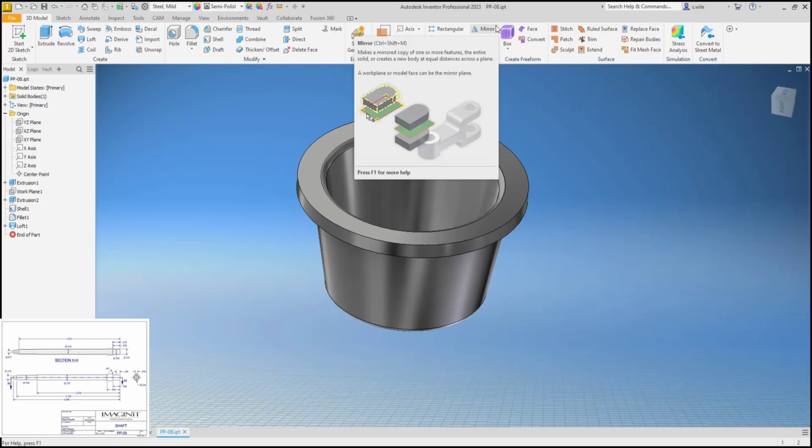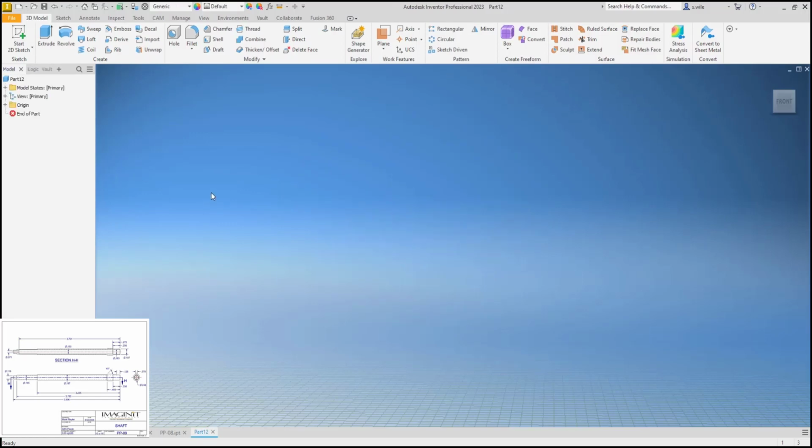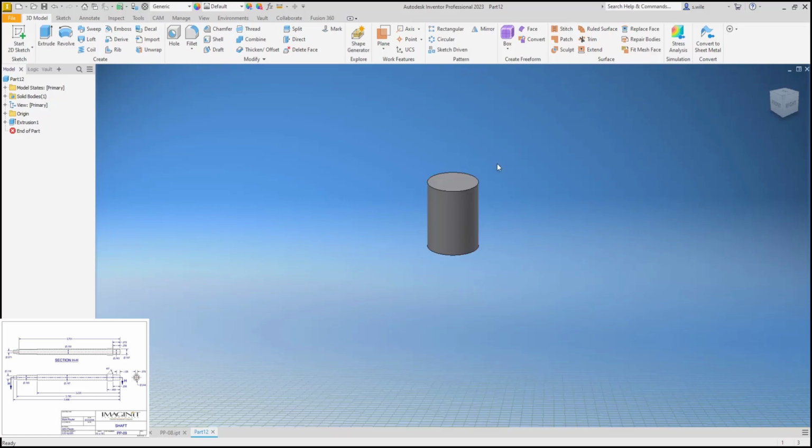We could do a revolve, but it'd be a pretty busy sketch. So I think I'm going to get the outside shape by stacking cylinders. Simple way of looking at this. So I'll start on the right side, 0.097, and that's going to go up 0.256. Looks like I have a double dimension on this print. 256 is on both views.